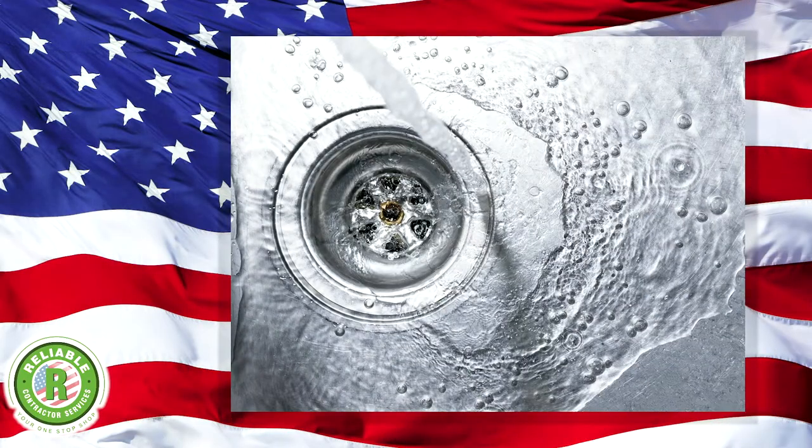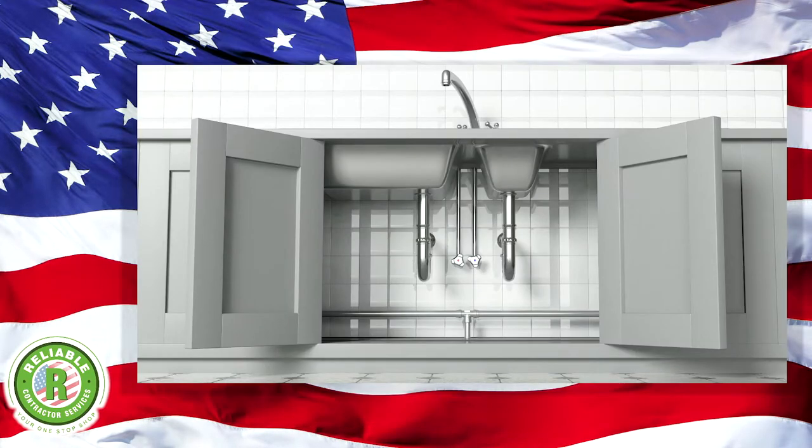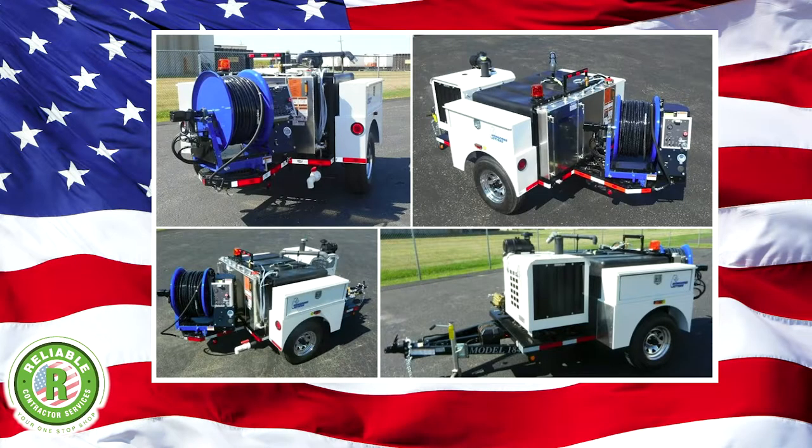Easy enough. There are a couple different types of drain cleaning machines or equipment that we use. You have conventional drain cleaning, which is generally done with a steel cable, sometimes known as rodding. We can clean just about every type of drain with that older style or conventional style machine. It makes a little bit more of a mess and it's sometimes hard on some of the old pipes — old clay pipes. If you start running a steel cutter down there you can cause problems or break something.